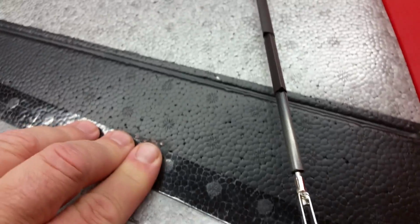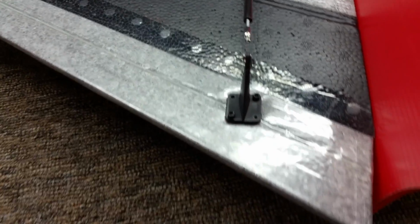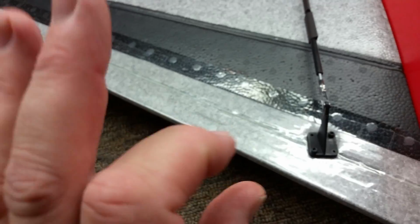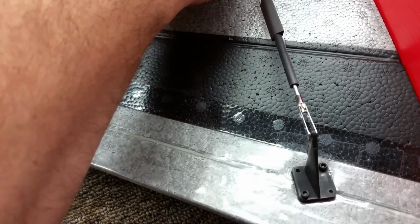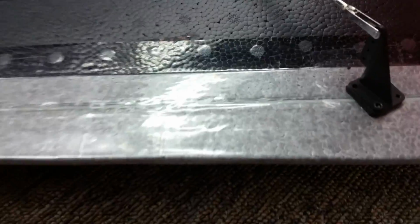And then when these rods are being used, you can see this one here tilts just a little bit. This allows it to roll a little bit like it needs to. So the ball links are a good thing. When this airplane's flying, the airplane is only moving about 1/4 inch up and 1/4 inch down from its neutral point. So the articulation on this, when you're flying, is about this much. So we're not worried about having these 90 degrees to the control surface.